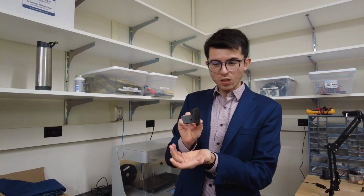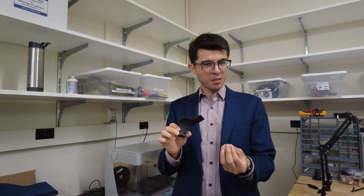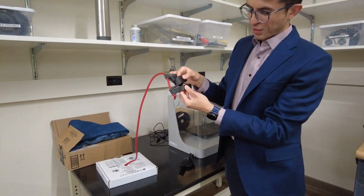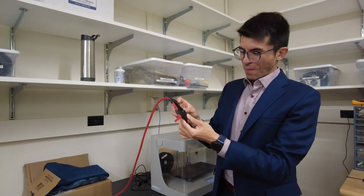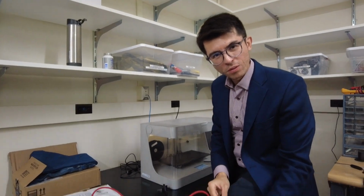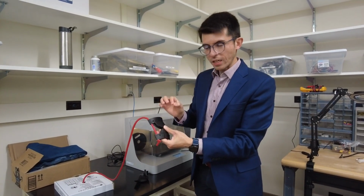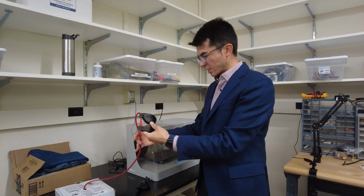So for example, you can get curves. You can print parts overnight. So that allows you to iterate super quickly. In here, there is an example. This part failed in the printing process, so please forgive me for that, just an attempt. But this is a knee joint for an exoskeleton to help people during the sit-to-stand task. And we are going to include parallel elasticity to reduce the motor size. So in the end, you have an exoskeleton that is light, and it helps you do sit-to-stand tasks.